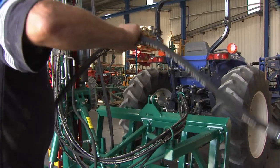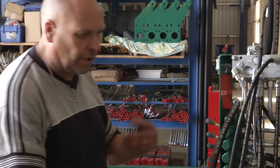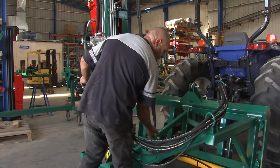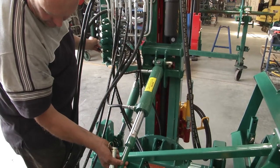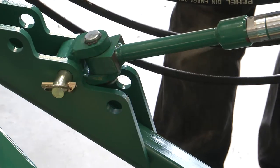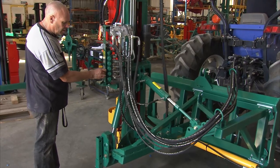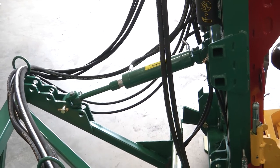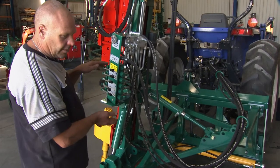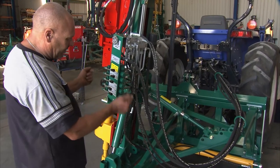The other hose is the return hose, and it needs to go into a return port on the tractor. Now we've started the tractor up and got the hydraulics running. We can operate the top link cylinder fore-aft function to hook up the top link. We need to hook that into the second hole from the bottom, and use the fore-aft control to bleed any air out of the cylinder. To hook up the Y-frame downforce arms onto the lower link arms of the tractor, we use the hammer-on function to retract the cylinder, which allows us to get the arms up against the lower control arms.